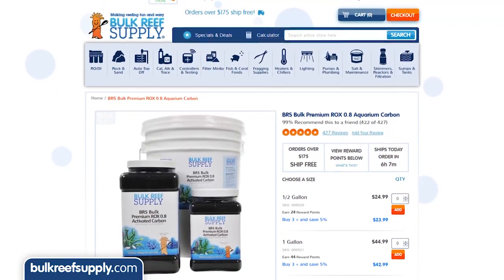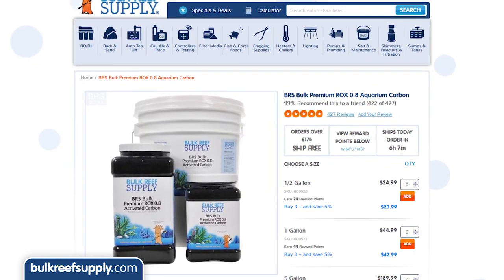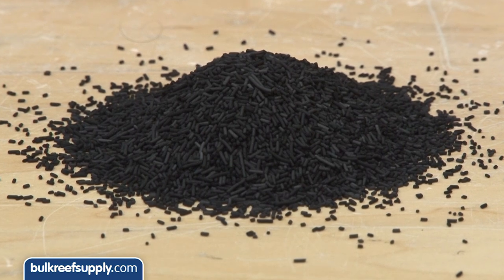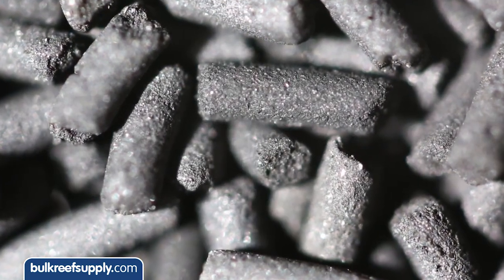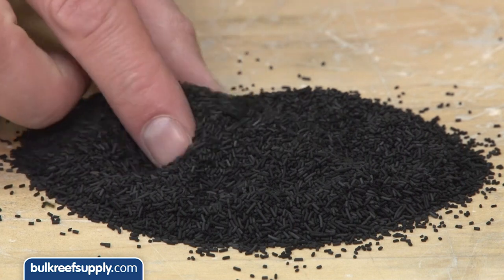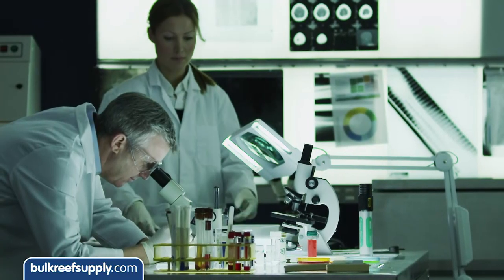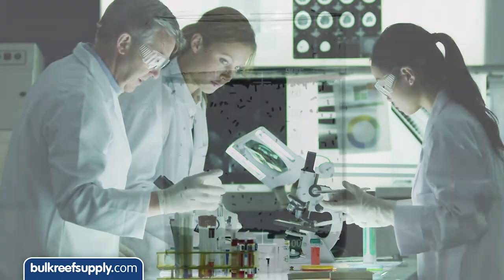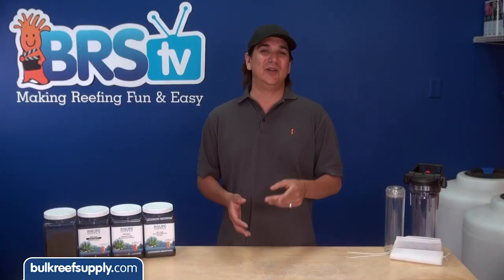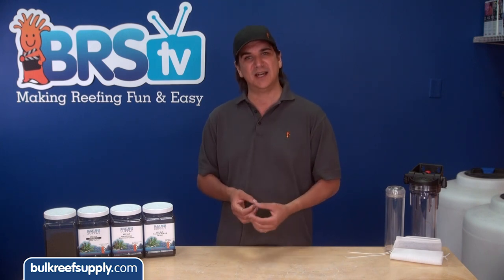The third type of carbon we sell is called ROX 0.8. While there is a price premium on this specialty carbon, it makes up almost 70 percent of our total carbon sales because it has some pretty unique advantages. ROX is a proprietary blend of different carbon sources which have been powdered and extruded into tiny pellets. The result is a wide array of pore sizes, making it the best at removing the largest variety of different contaminants. The tiny pellets are also super hard, which makes them almost dust free and they rinse in seconds. ROX 0.8 is really designed for ultra pure water applications like pharmaceutical intermediaries where contaminant removal standards are extreme and it is critical that the carbon itself adds as little to the water as possible.